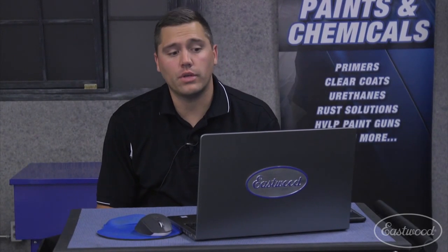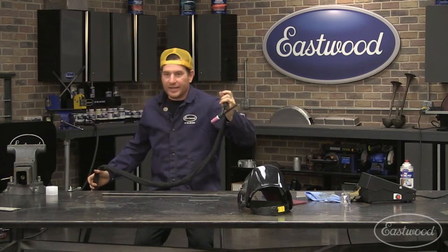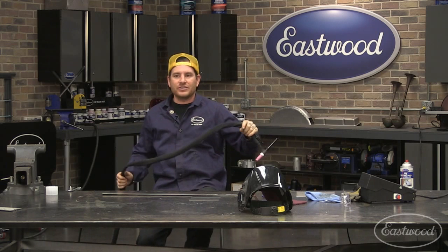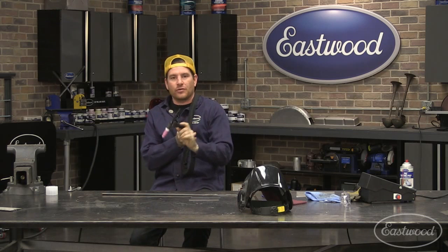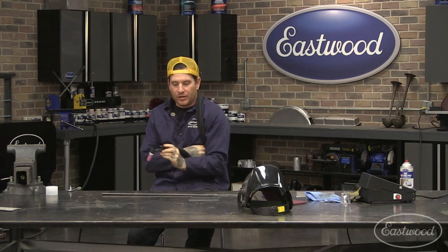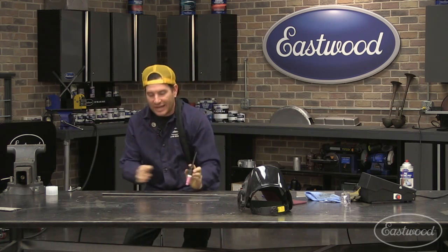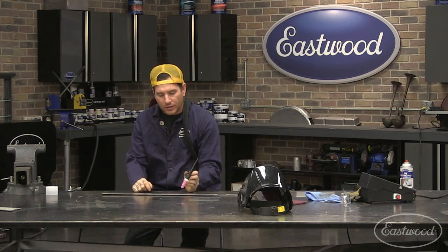Sure, we got a good one for you. They wanted to know about whip management when welding, and how to control the weight while welding to avoid getting it tangled or anything like that. So the torch, when you're trying to weld, again, this is a personal preference thing. The way that I do it a lot of times is I throw the torch over my shoulder like that, and most of the weight will be over my shoulder. I just have a little bit right there under my arm, and that will give me enough slack that I can move around anywhere I want, and I have all the weight pretty much off of my hand. So that's a good way to do it.